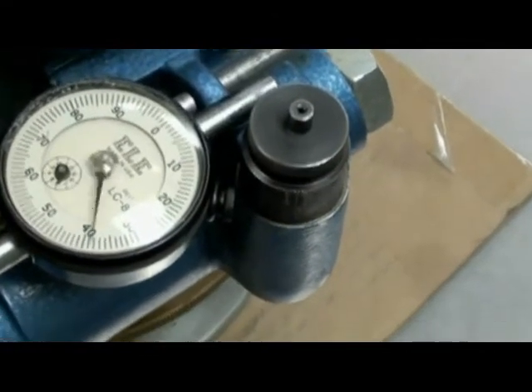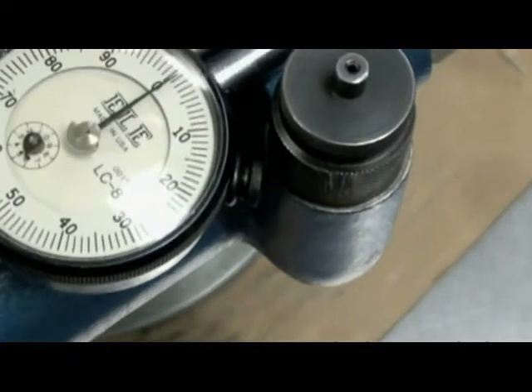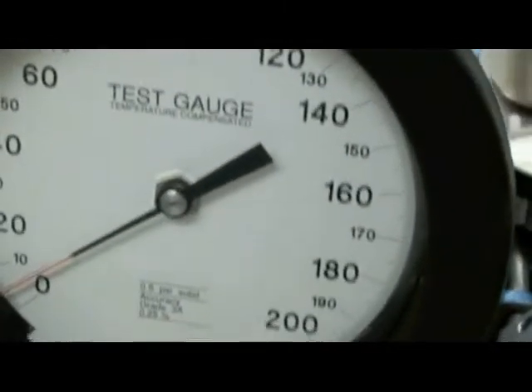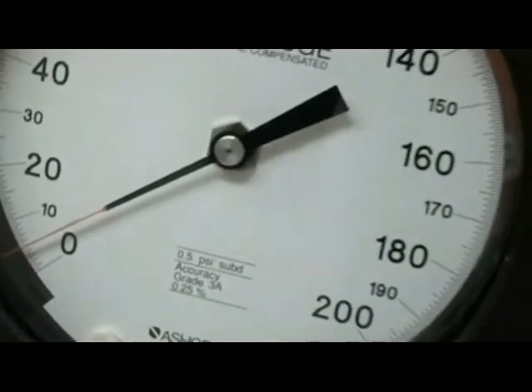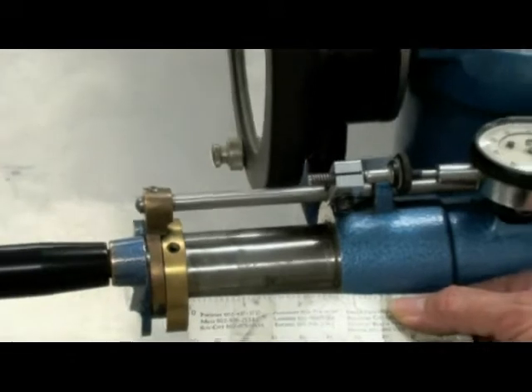Then look at the horizontal pressure dial to see if it is at 5 PSI. If the needle is a little above 5 PSI, you'll have to let air out; if it's below, you'll have to let a little air in. With the calibration cylinder still in place and set at 5 PSI, you'll measure the exposed piston length, which needs to be 2.8 plus or minus 0.2 inches — this tells you if there's enough oil in the bladder.